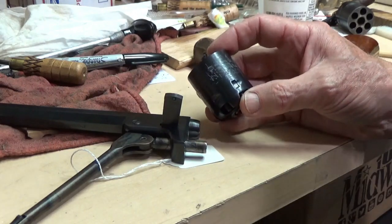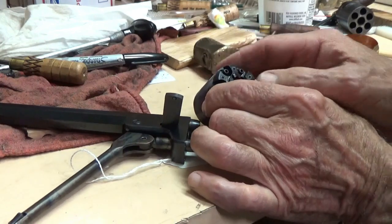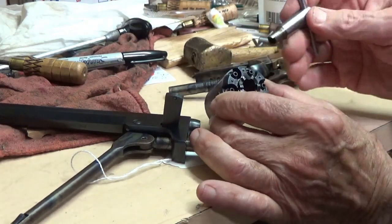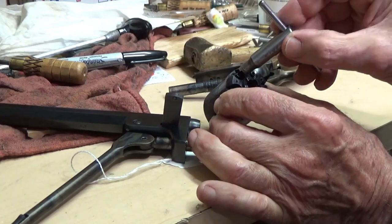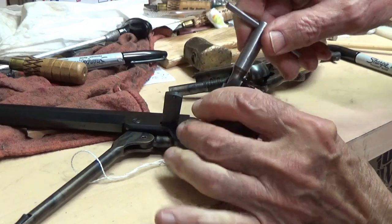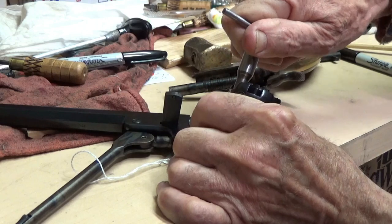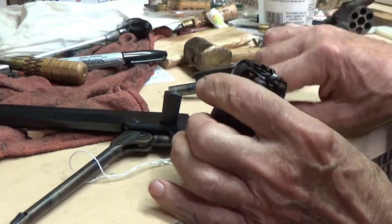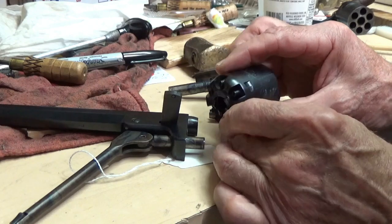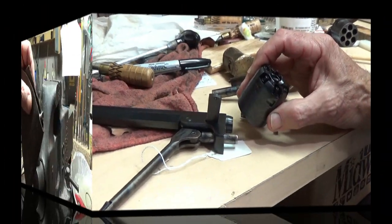I've got a method that kind of helps with that — you can check online and do some research, and I think I might do a video on that a little later on. Cylinder's out, let's see what we got with the nipple wrench here. I'll use the one that I prefer, set that down in there, and just see by hand whether I can get that to move. I'm not going to try it too hard. Okay, I'm not getting that to move so I'm going to assume I haven't had the nipples out of this gun. I'm going to take it over to the vise and use that method I was showing earlier and see if we can get some of those things freed up.